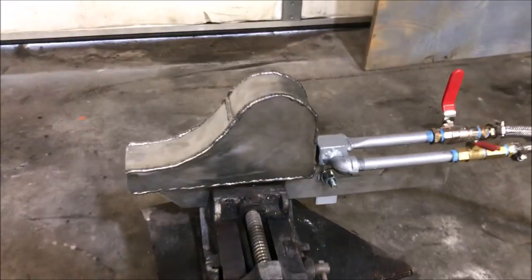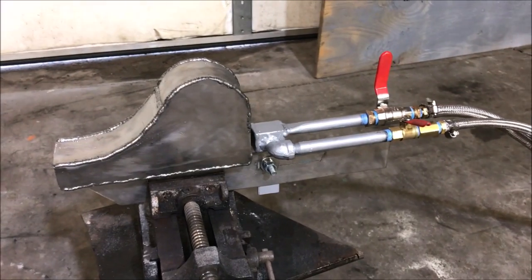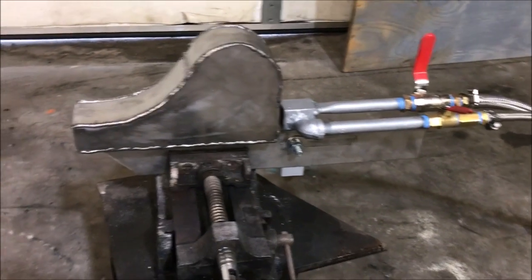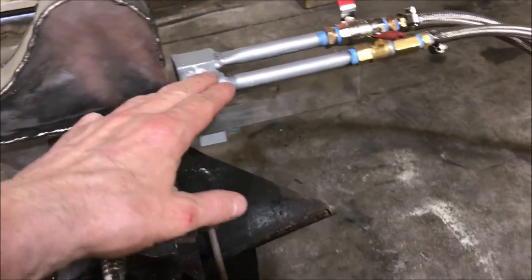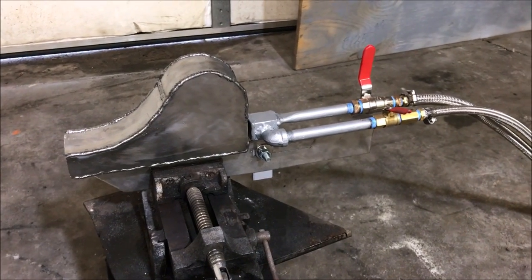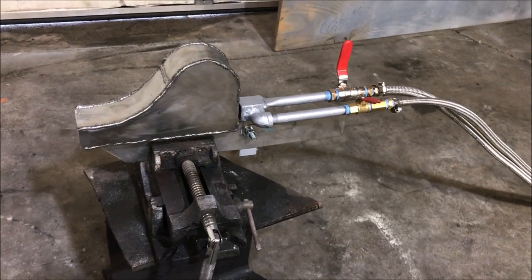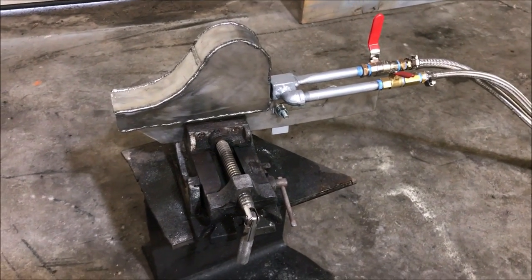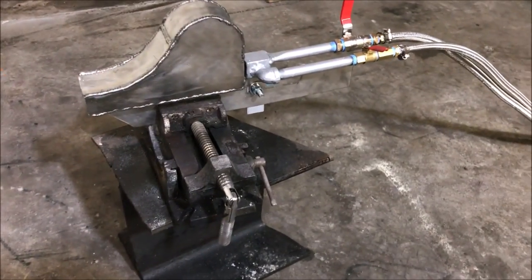This is a different burner than what I showed you the last time. I've decided I wanted to give you something a little bit better and more reliable than the version I showed you. This device should need cleaned far less, and this nozzle puts out twice the energy of the other nozzle. And I noticed the specifications of the burner you guys are currently using had a minimum of 150 kilowatts. So today we're going to be running this device and seeing what it can crank out.